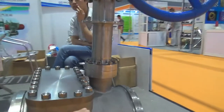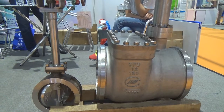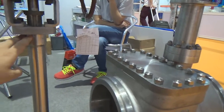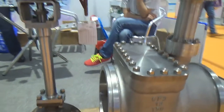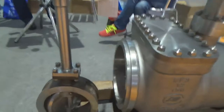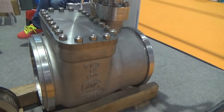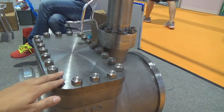A triple offset butterfly valve working in a low temperature flow control system - most of the time this kind of butterfly valve is going to control natural gas like LNG in control industry. The reason why we designed this kind of long neck on the top of the butterfly valve is because we are going to put the packing in this area. If we put the packing at the top of the valve body, the low temperature will destroy the packing and the valve will leak. So that is the reason why we designed this triple offset butterfly valve with a very long neck. And beside this small triple offset butterfly valve we have another one - this one is a little bit special. The reason why we designed this kind of flange to cover this area is because if the valve sealing face is going to leak the valve seat, we can change it from this area - we can open this area to change the valve seat inside.